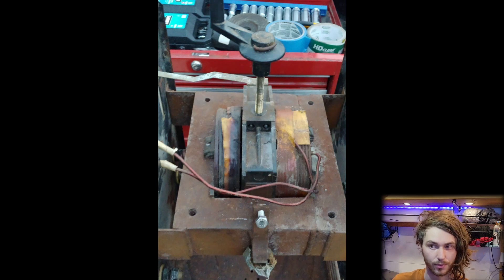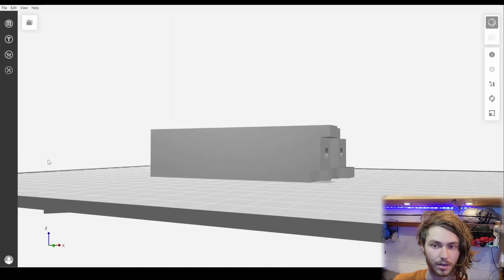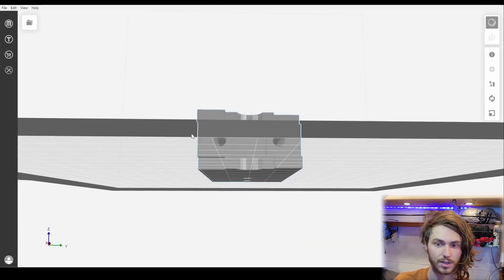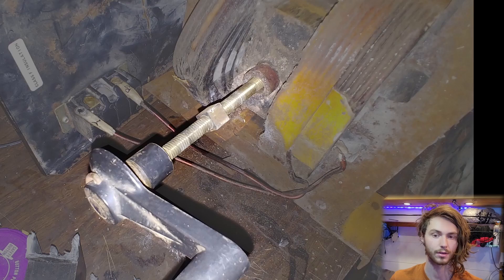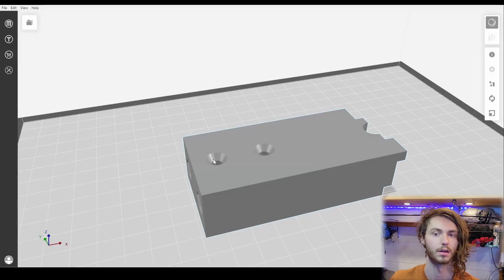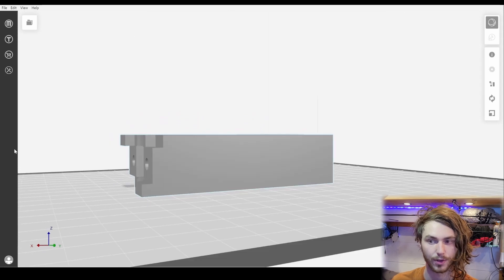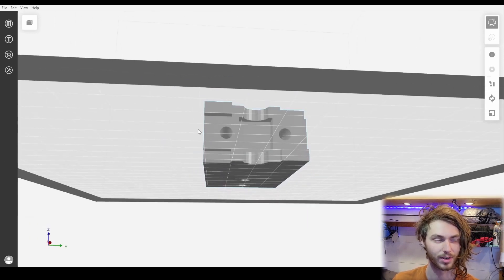The shunt cracked and broke due to rust debris and the weak design of the part. After doing all this work and finding that this part is no longer available, I spent hours 3D modeling and printing prototype parts until eventually settling on a final design. I designed the part in two identical pieces that fit together, since they have to be bolted together lengthwise after a small cube on the threaded rod is set between them. That is how the shunt adjustment moves — the handle is spun which screws a fixed threaded rod inserted through the cube. It is an awkward, weak design prone to failure, and the manual calls for disassembling the welder regularly to apply grease to this just to avoid it breaking. The part gets very hot and standard 3D printing filament will not cut it — the part exploded when I used the welder with regular filament.